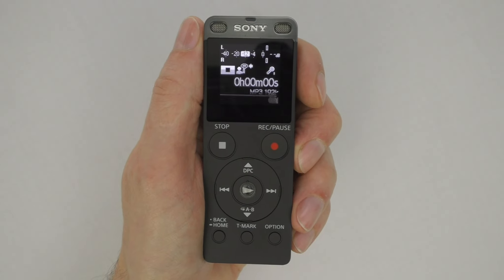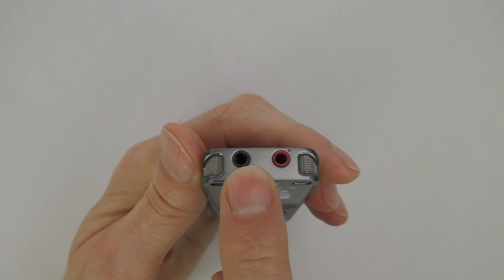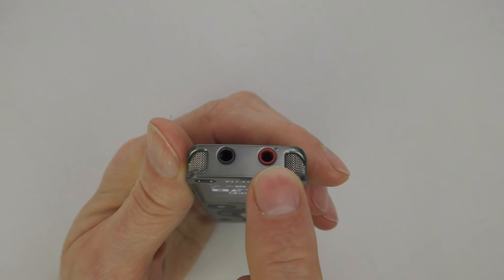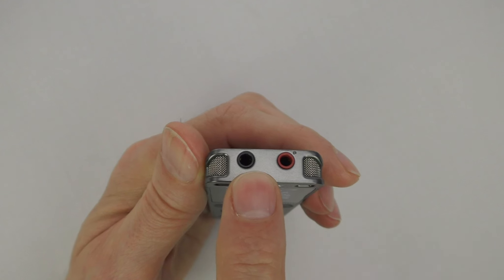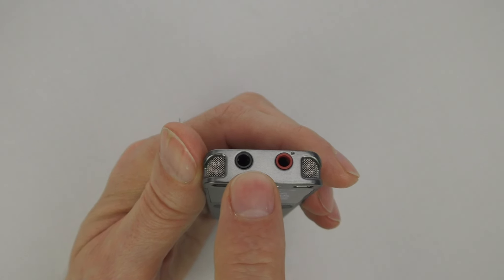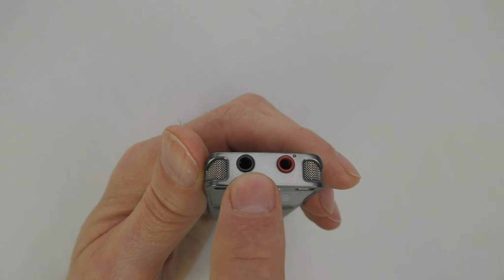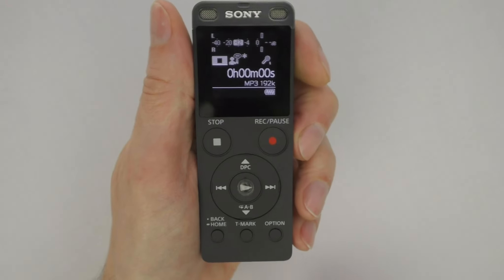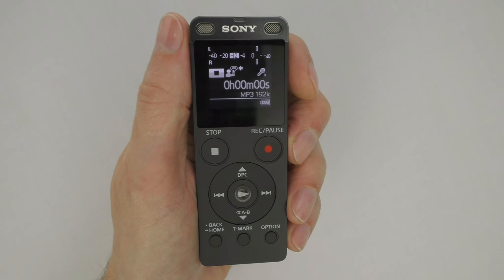To stop recording, press the Stop button. The recorder has two input jacks: a red external microphone jack and a black headphone jack. The red jack is for the trunkline connector cable, which connects to the remote pause switches — those will be covered in another video. The black jack is for the audio feed; depending on which secret prompter system you have, this plug is for the neckloop, multimedia hub, or touchscreen mic. Sound is transmitted from the recorder through one of these devices to the earpiece.